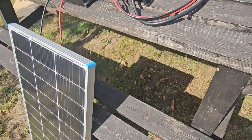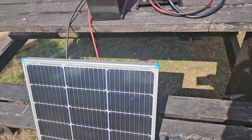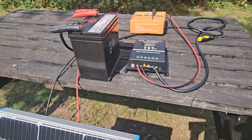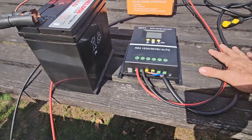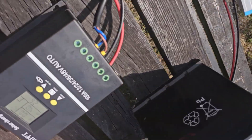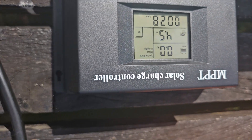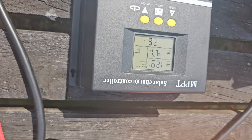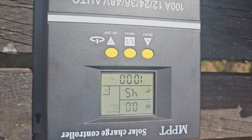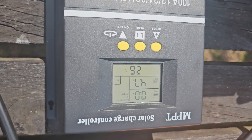Conclusion: this is working perfectly. I'll leave it for a couple of hours to charge the battery. It's one of the simplest designs you can get — solar panel, battery, charge control unit, done. The voltage started at around 10-point-something and now we're at 13.1 volts. It's going up as clouds pass. 12.5 now with cloud cover, back to 12.8, and there we go — 13.1 volts. If you enjoyed this simple setup video, please like and subscribe. Take care and catch you in the next video.